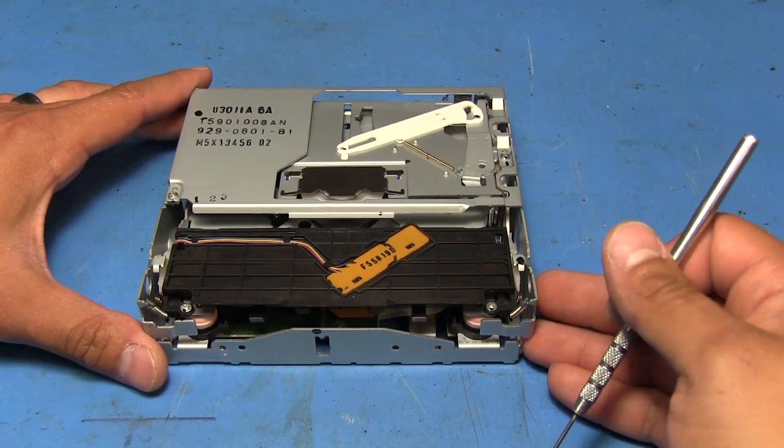What I usually do to run these when I don't have the rest of the radio is I'll disconnect this flat flex. The two farthest contact points on the right are the ones that run the motor that does the loading and unloading. I'm going to have to double check, but I believe those are the ones. I'll pull this out and set it to the side so I can have easy access to those two on the right, and we'll test it out first to see what the issue is.